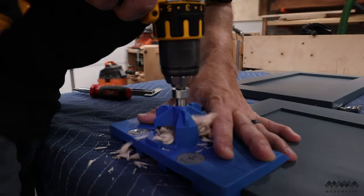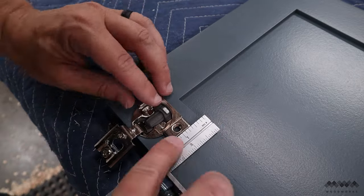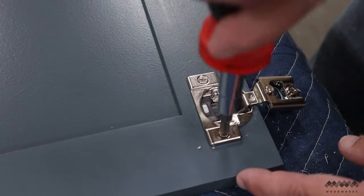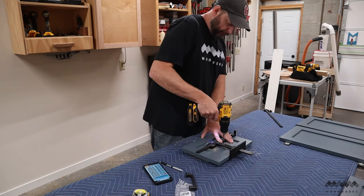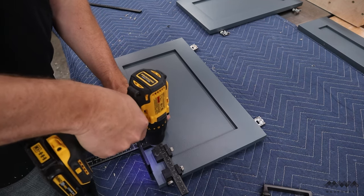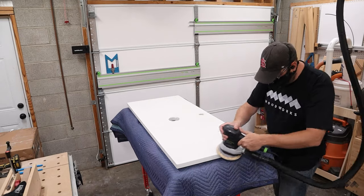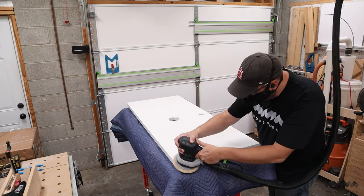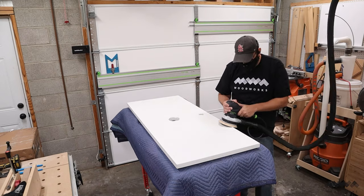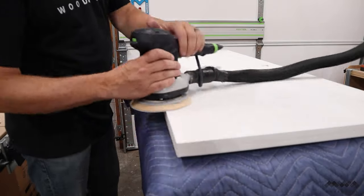While that's curing, I go back and add hardware to the fronts. For the doors, I'm using Euro-style hidden hinges and begin by drilling the holes for the hinge cups using a jig with a 35mm drill bit and drill guide. For drawer fronts, I'm using a True Position jig with three adjustment points to place my drawer pulls perfectly. Then for the concrete top — I sand the bottom edges to create a small chamfer and clean up any sharp or crumbly areas. This is surprisingly easy to do with just regular sandpaper for knocking down rough edges.